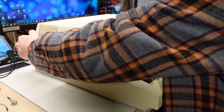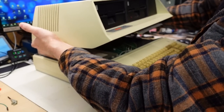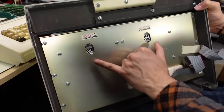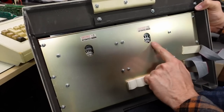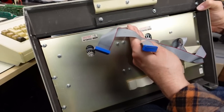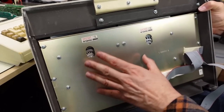To open this computer, it's exactly like opening a regular Franklin Ace. There are little tabs you bend backwards, then you lift up on the entire upper module and it comes off. I already have it disconnected from the disk drive controller — if it were still connected, you have to make sure you don't yank this out because it will pull the disk card out. This is the bottom of the top cover, which has the two disk drives mounted with four screws. The floppy drive interface cables are just the normal standard Apple II 20-pin interface, so these disk drives would work perfectly on a standard Apple II.